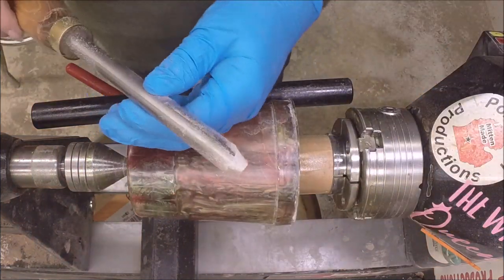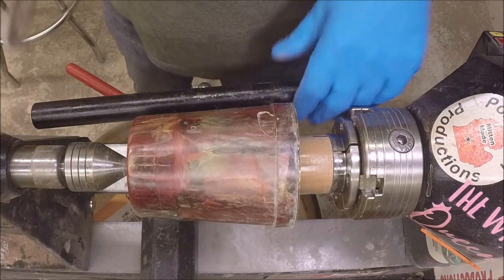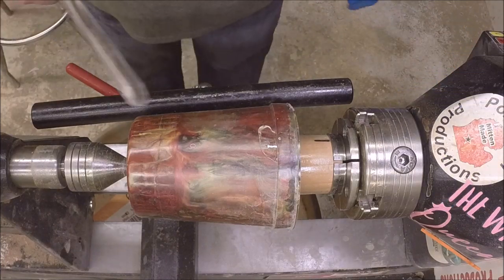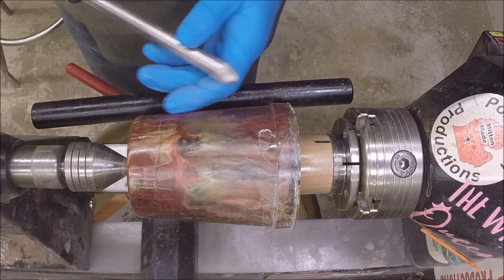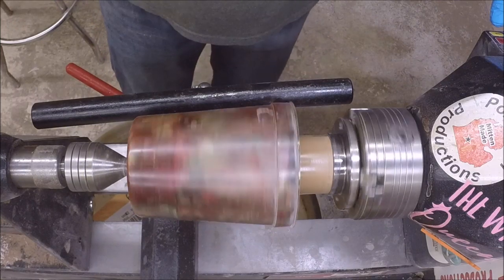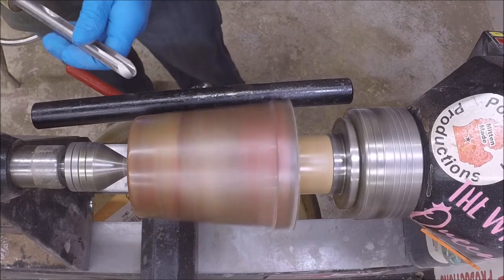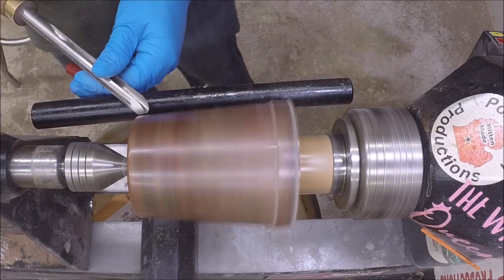I'm going to start off with a traditional tool and probably get the carbide, because for what this is, the carbide's just the tool for the job. I seem to have better luck with this, as I don't have negative rakes, getting my cuts going, because carbide on a brand new fresh cut tends to chip out. So 100 is not going to work. So 1250, she didn't look too bad, but pretty much all I'm going to do is level this out and then we'll go from there.